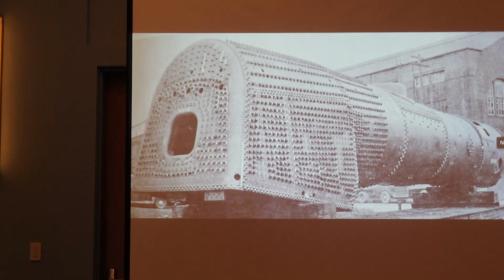So would you just continue on to wherever you're going, or would you shut things down? Depends on how bad it is. Okay. Because you can have stay bolts leaking, as long as they're not ripping. I've seen where stay bolts are blowing, so they break at the telltale hole, and you'll have a part of your fire blowing so much water and steam in there that your fire goes out in that particular area. And sometimes if you want to continue on, you might not be able to because you can't make enough steam. So it's like a foolproof thing in a firebox. You're not really going to get in trouble unless you continually go and you have a really bad crack. Well, then you're asking for it. But it gives you plenty of warning: hey buddy, maybe you ought to take a look in here.